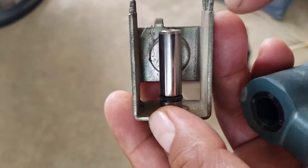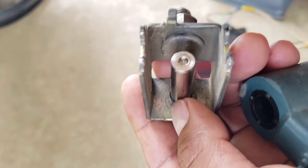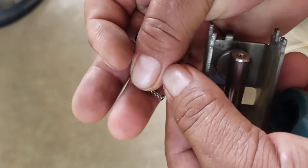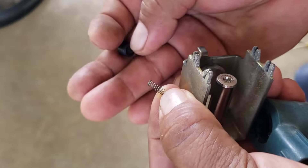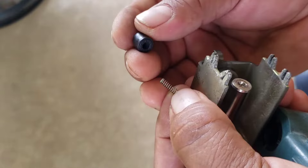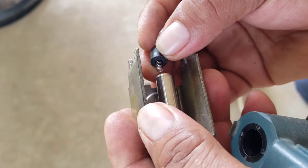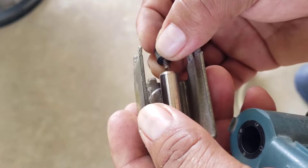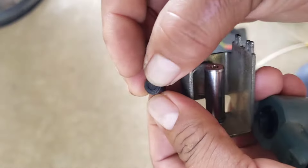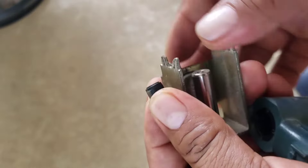This is how it looks inside. There is an o-ring right here, and on top there is a small spring. This little tiny spring goes in that hole right there. Over here there is a half-metal, half-rubber piece — this spring goes inside here like that. It goes up right there. If that spring loses tension it will leak air as well. At the end right here it's like rubber, kind of like a seal.